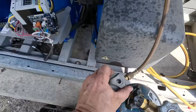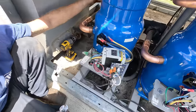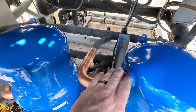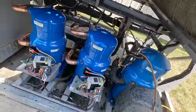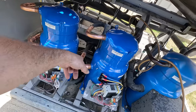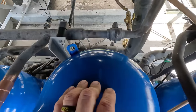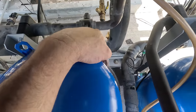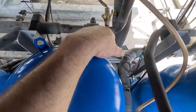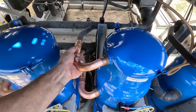There's some leaking here, too. Obviously I can't shove it through the compressor, but we can at least purge it out as best we can. You can force it through the suction — problem is then you'd have to pressurize the whole thing. I don't think I have any ball valves. I have a ball valve there, but the idiots put the ball valve on the pressure port on the wrong side, so I can't even utilize it. So we're just going to do our best to get her purged out.